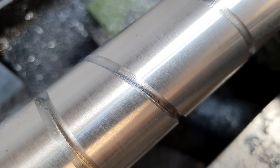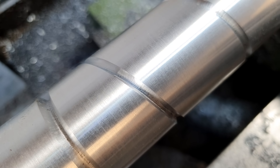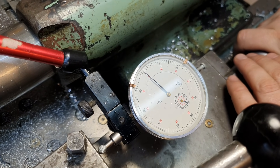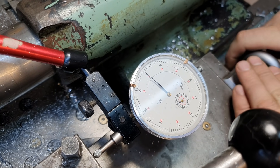Well, I think it looks very, very decent. You could actually do it in 4 passes instead of 3 — meaning the last one not as 0.9mm but split into 0.5 and 0.4, then the finishing pass — that would be even better. We shift by 4 millimeters on the indicator: one, two, three, four. Bellissimo!